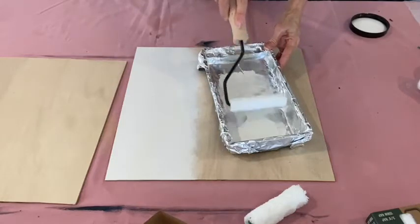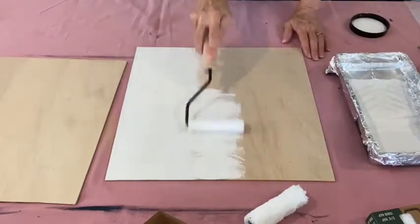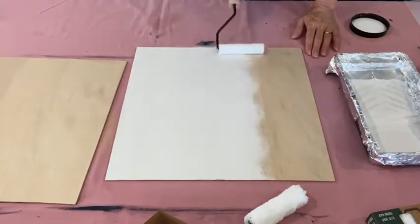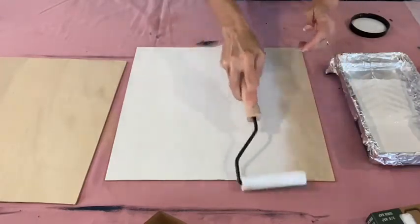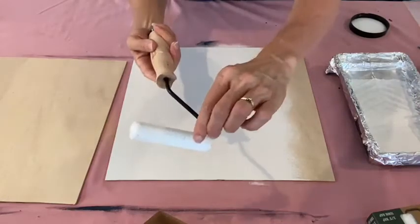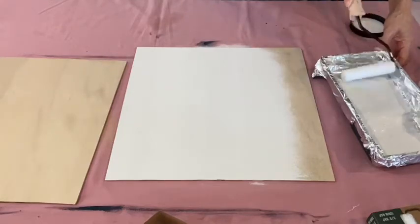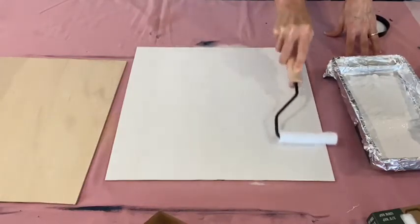If you've never used a roller before, it does make really super quick work of your furniture painting, especially if you've got really nice big surfaces to work on. This is raw plywood, so it'll be a little bit different if you're working with something that's already got paint on it. This is just soaking right into the wood. I can see a little bit of fluff coming off the microfiber roller. Like I said, first time use, you probably want to do what they say — rinse and spin before you begin. Sharon did not do that today, but that will help to remove some of those fibres that might stick out a little bit.